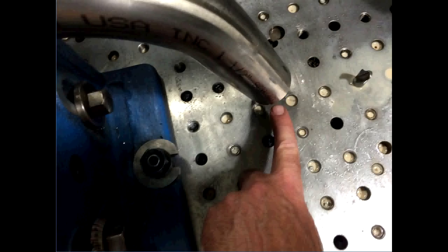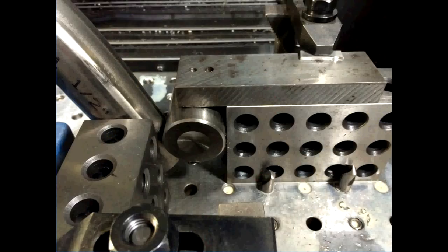My table has a lot of holes in it — every other hole is a half-inch dowel pin or a half-inch 13 bolt hole. I've got a couple of center drills that slide in there nicely. This piece here is from my old mold-making days — it's a large two-inch diameter roll, actually an old two-inch diameter end mill, and I was able to EDM a hole through it and bolt through it. I used this to check angled walls on cavities and cores, but for this purpose it works great as a stop, because when you're working with angles you need a round surface to hit the angle in the same spot every time.